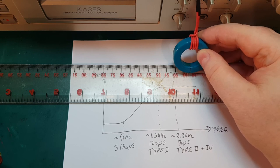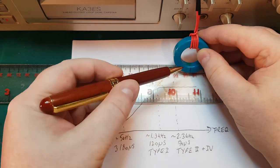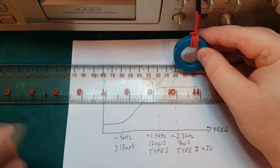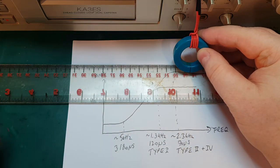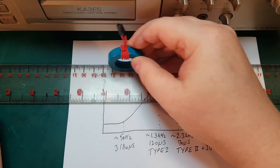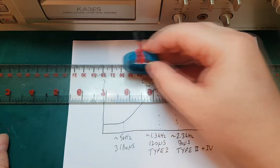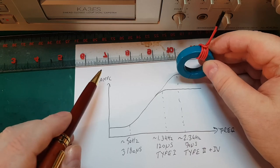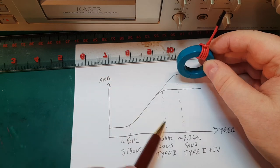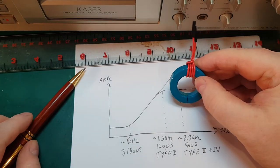And let's talk about how we play back the signal then. Well, it's exactly the same as the recording head. So the playback head, well, of course, in practice there will be some differences, but in theory, exactly the same. The head will be the same with our small gap cut out here. And of course, we don't apply any bias. We just run the head along the tape here, and then we will have an output here, very small output, with our music signal or whatever was recorded on the tape. And then we apply the opposite equalization curve here, so the low frequencies will be amplified and the high frequencies will be attenuated. And then after this, we'll have our original music signal again.